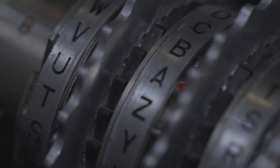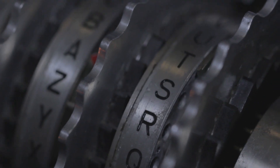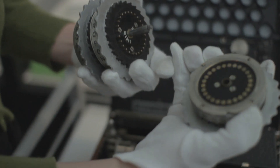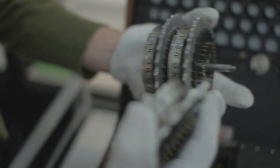If we look inside I can show you the rotors. You'll see this machine is a three rotor machine and I can actually take those out. Each of the rotors has 26 different connectors, so you can transfer a letter coming in from one end into a different letter, and it passes through each of the other two rotors — giving over 15,000 different settings for each letter.